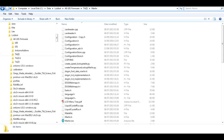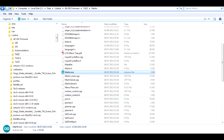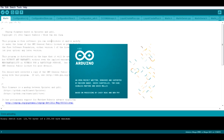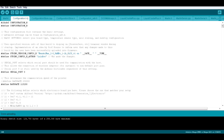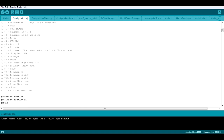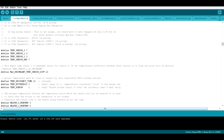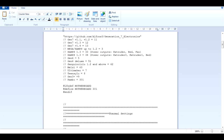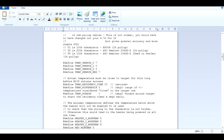I've downloaded and unpacked the firmware using 7zip. You should find a directory called Marlin with lots of files, including the Marlin INO which is the Arduino project. You'll need Arduino 1.0.5 for this — there are some incompatibilities with later versions. I've opened the Marlin project and we can see all the code including various tabs. The majority of the changes need to take place on the configuration.h tab. The main things to change are the thermistor settings, which we need to compare with the AO101 firmware. I have the AO101 configuration.h open in WordPad so I can view settings without getting confused between two Arduino versions.